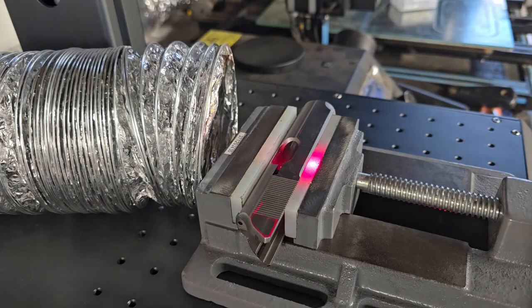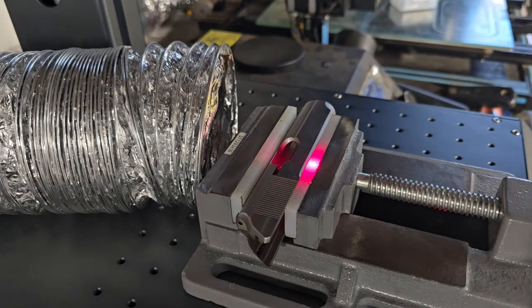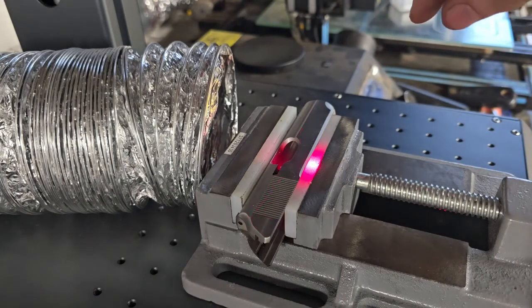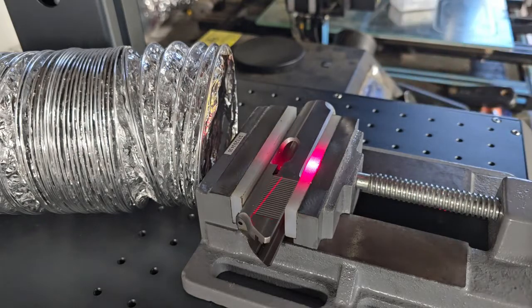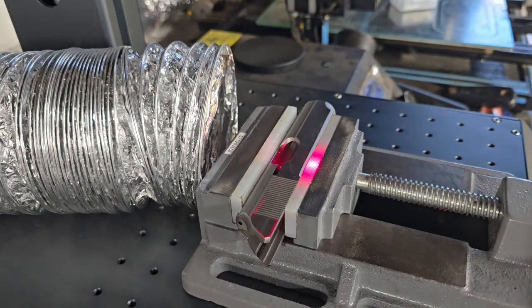This is probably the most nerve-wracking part — aligning it. What I did is take the outline, the furthest outline of the whole thing, and I'm going to do a real light burn, because the laser might look okay but it could be off a little bit. If I use just the tiniest bit of laser, we can get that lined up real good.